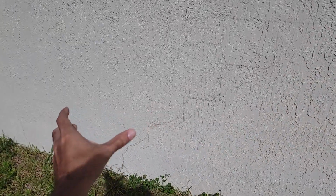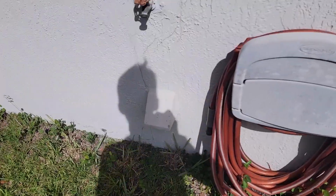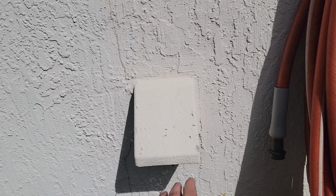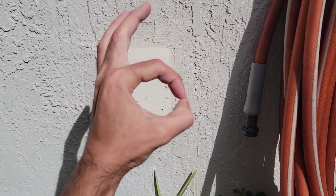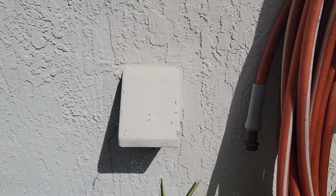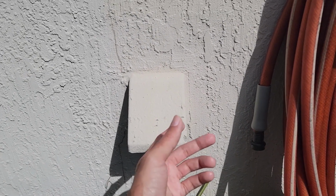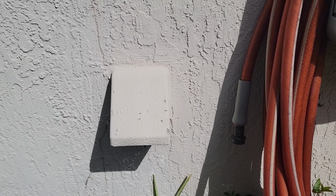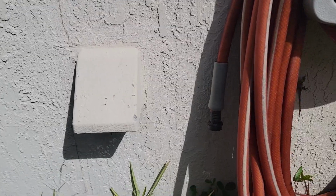So we got to punch a hole through, and that's where the hoses are going to go. Now the hoses on the C2 unit, if you looked at the overview video, it's not small. So we would need a hole not as big as the dryer vent, but maybe about 3 inches, right? Because it's the neck or the brass fitting on the end that's the biggest part, and we need to get 2 of those through. But then I also want to make sure that it's securely filled in or protected or sealed, to make sure that bugs and lizards and stuff like that don't get through. So maybe some type of door.